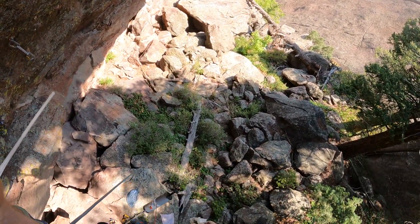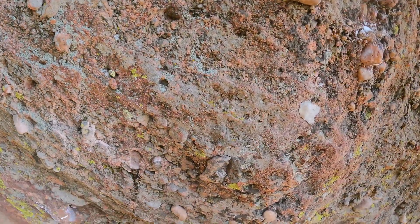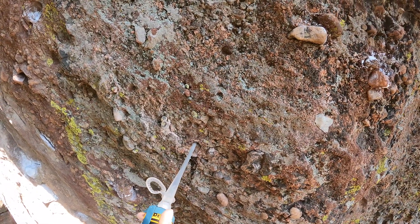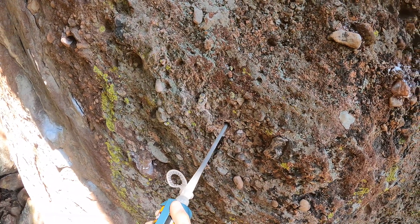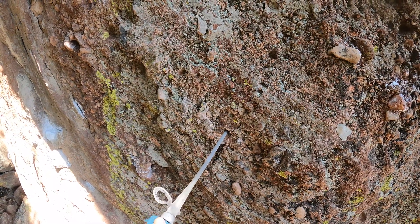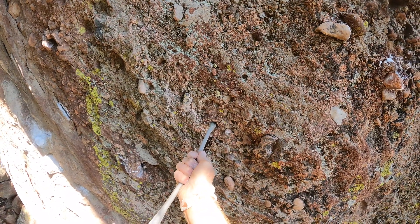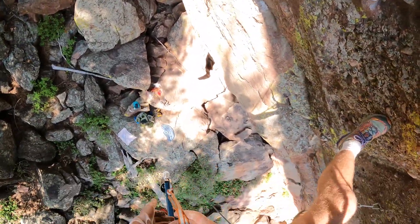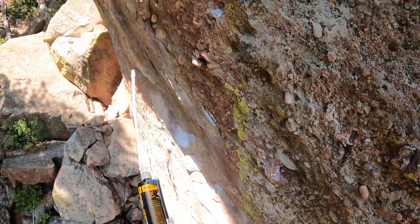This does waste a little glue, but you really want it to be mixed in the mixing nozzle before you're trying to do some bolting with it — quite a bit of glue I've just squeezed out. I'm going to toss that down by my stuff. And we're just going to go straight into the hole, as deep as we can, and start squeezing. As you back out, squeeze — these big holes are going to use a lot of glue. Getting close to the front here. Some is going to spooge out, so we don't actually need to fill it 100%. It doesn't look like it's going to drip, so I'm just going to back off the gun a little bit.